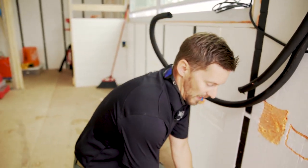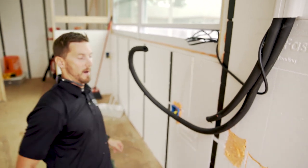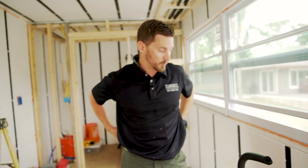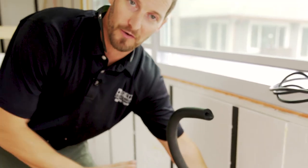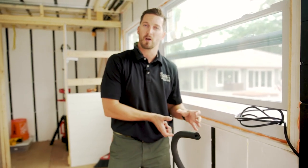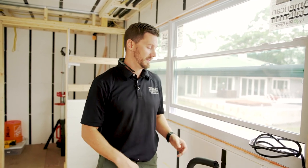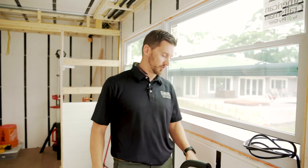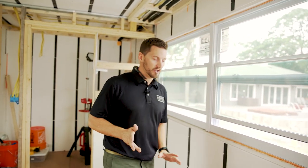This was a good tool that really helped the process. But some of these boxes we could not get to grab, especially when we had a lot of wire in one location. Since our electricity is off, I can grab some of them, but when we mounted these boxes all those wires were trying to push the boxes out. Usually when we do framing, we mount the box and screw it directly to the framing. In this case we couldn't do that — foam is really the only thing holding the box, so we had to rig some stuff and weight it against the wall while the foam dried.